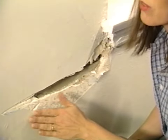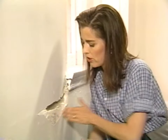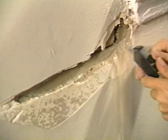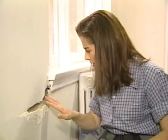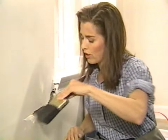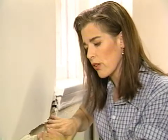I'm starting to get to the point — I think there must have been some moisture damage here before because the surface of the plaster is kind of hacked up. But I'm getting to the point where the paint is tight against the wall, which is a really good sign. It means we're getting to the end of this monstrous crevice. Underneath the plaster there is actually some kind of wall board, and underneath that all I can see is two-by-four studs. This hole is so deep that I'm going to put a little bit of drywall compound into it so that it's not so spongy.